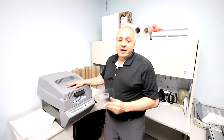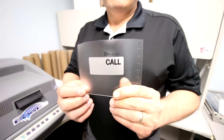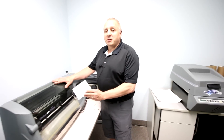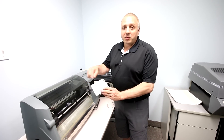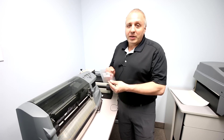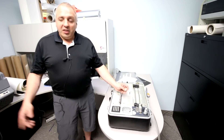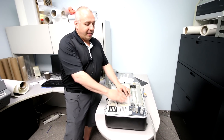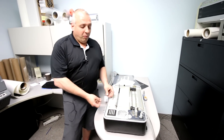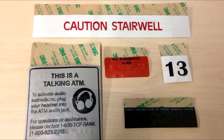This is our Gerber Edge, and on the Gerber Edge we can actually print our decals to make labels and decals. After they get printed, they go to this machine and the shapes get cut out — you'd see a hole get cut out. Then after we have it on this material and all cut out, we take it to our braille machine. On the braille machine, we put the decals in and it embosses the material for our decals, and once it gets brailled you end up with your finished product, which is your cut-out label.